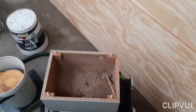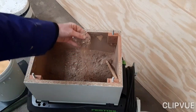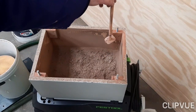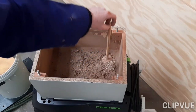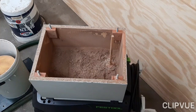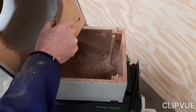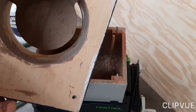You can see that it actually is quite fine material that makes it down into the collection box. This little pin here is one I made that I pull up to the top of the lid and it drops down so I can figure out how much space is still at the bottom of the box and how much volume I have left. And you can see the bottom of the paint tin where it is screwed onto the box and the shape of the thien baffle.